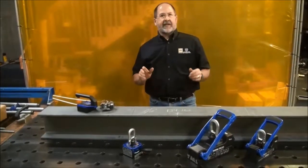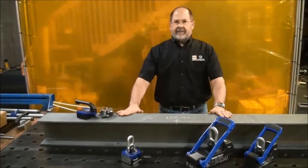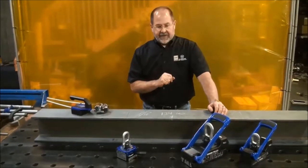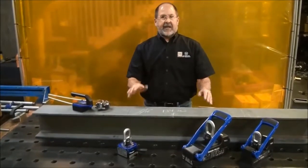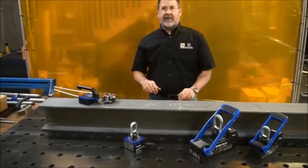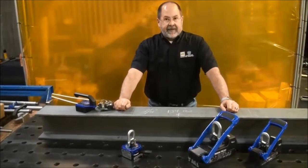This is the kind of company that does a lot of lifting and uses a magnet to lift their steel pieces — a lot of I-beams, a lot of square tube stock. They actually go through and weigh every piece of steel so they know what they're lifting. They mark center lines so they know exactly where to put the magnet. They know how thick the steel is, how much it weighs, and what their magnet can do — but they don't know what their magnet can do on different thicknesses of steel.